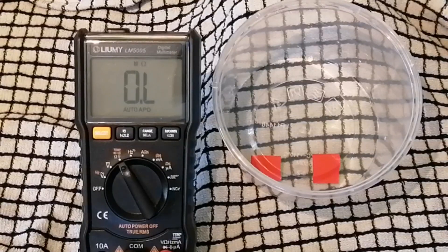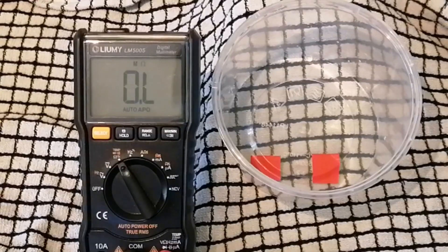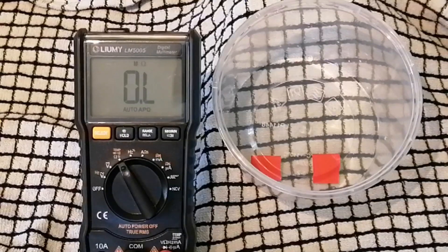So why does being by the sea enhance your radio signals by up to four times compared to sending that same signal over land? Water is a conductor, as we know, but not as good a conductor as you may think. Freshwater is far less conductive than seawater, and it's the addition of salt into the water which gives it that sharp edge as far as RF radio waves are concerned.